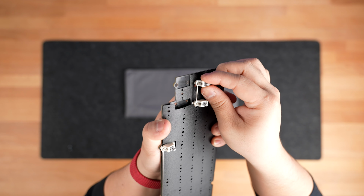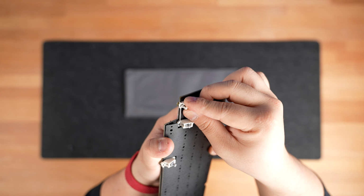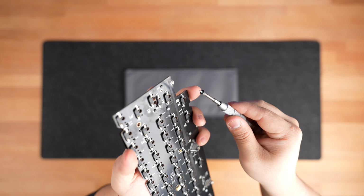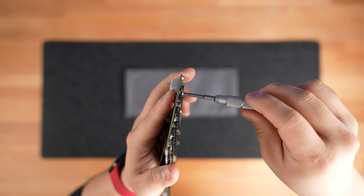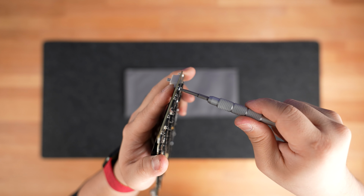It is highly recommended to pre-lube your stabilizers to prevent rattling sounds, and we'll leave a great guide linked in the description on how to best do that. To install your stabilizers, insert the non-threaded end of the stabilizer into the larger cutout on the PCB and pivot the threaded end into place. While holding it from the front, screw it into place from the underside of the PCB with your stabilizers' included fasteners. Some optionally also come with washers that you can choose to use.